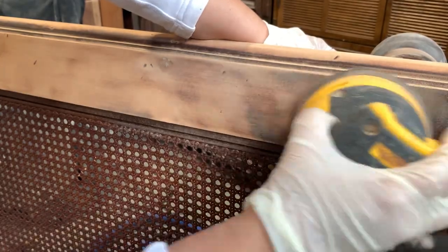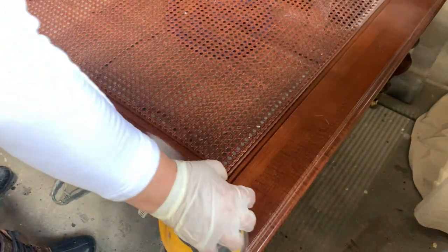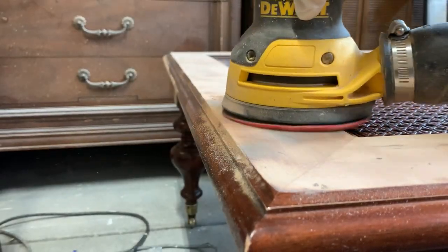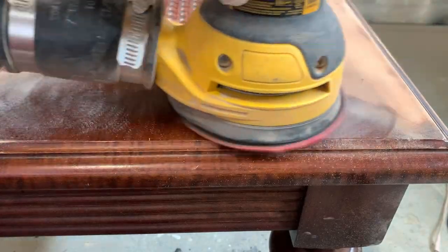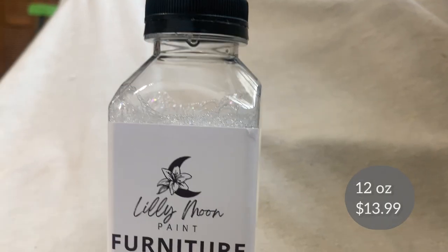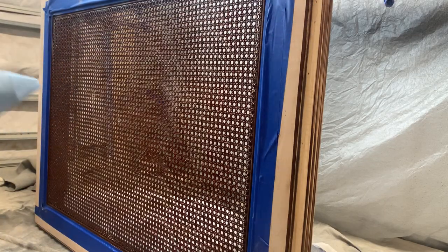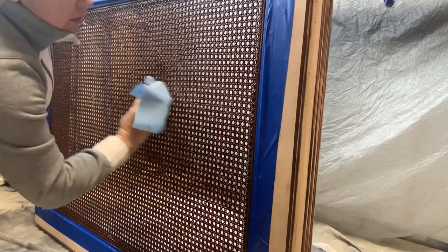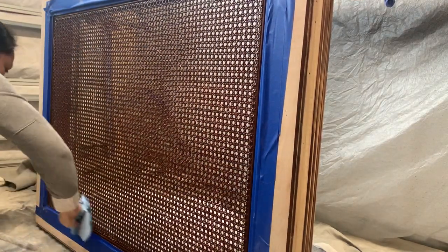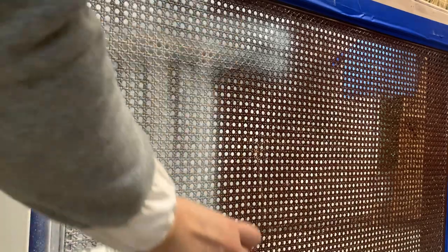As I'm sanding, I'm thinking I should probably prime the cane before I do anything else so that if there is any overspray, I don't have to re-sand those areas. In today's video I'll be using several new products, and one of those is this Furniture Prep from Lilymoon Paint — a solution that needs to be diluted with water. This cleaner will help get your piece ready for priming. Something I love about this product is that it's odorless, colorless, and leaves no residue behind. Just make sure your surface is completely dry prior to painting. I'll be applying two coats of bin white shellac base primer — light coats are best.